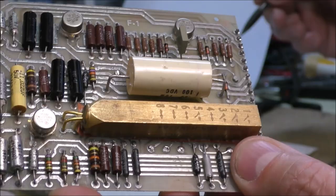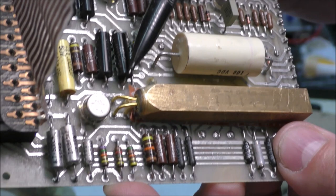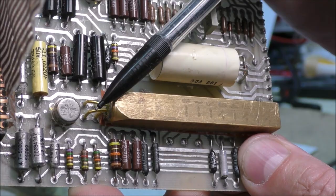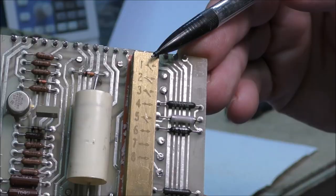On the left here, there are four terminals, but as you can see, two are connected together, two terminals on the top, and the two others are connected. And I have measured also a perfect short circuit between these two pins. So I think that this is the second answer, but I am not totally sure.